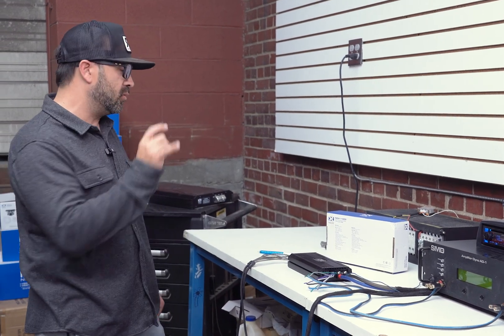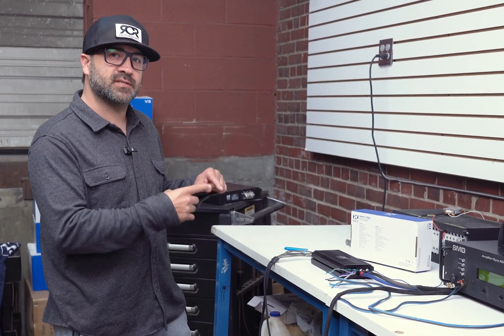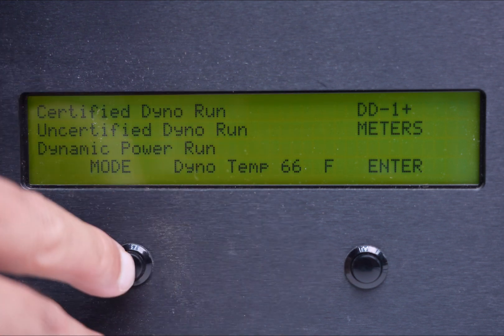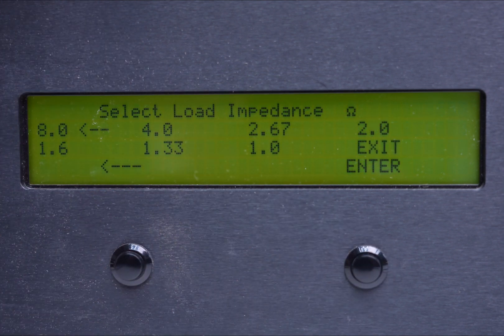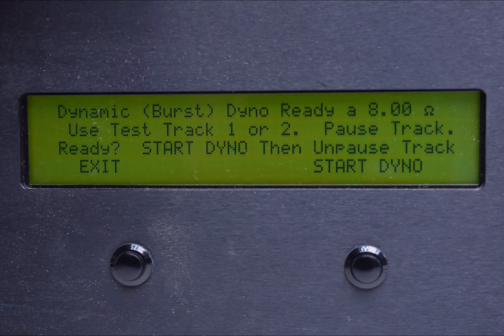After the four-channel tests, we'll go ahead and hook up the fifth channel so you can see how much power you get for your subwoofer. When we run the dyno, it's going to look a little odd because we have it bridged, but that's intentional so you get a better idea of the power with the channels loaded down. At 8 ohms bridged, this represents what you'd see out of this amplifier as if it were at 4 ohm stereo.